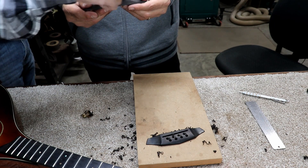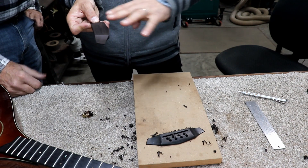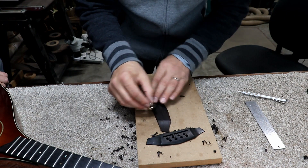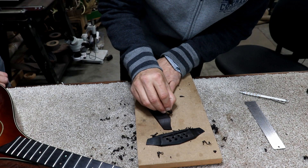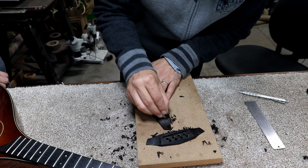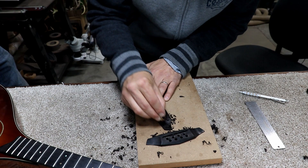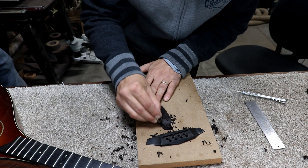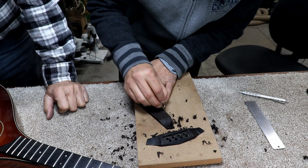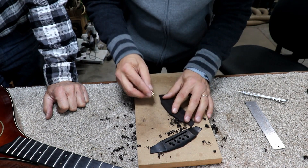One of the reasons it's cutting harder on this side is because you're going into the end grain. You can go that way — that'll make it easier to carve, though it's harder to reach across like you're doing. Wood likes to be cut one direction and only one direction. You just have to learn what direction that is and then go with it. After a thousand things, this is really easy, but that first thousand things is a little tricky.